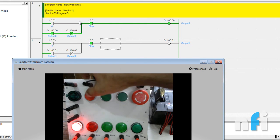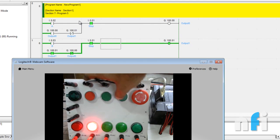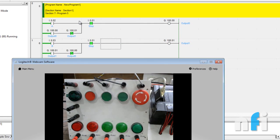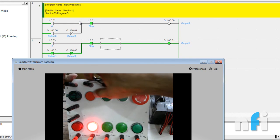This output is latched. To break the latch logic, I press 0.1 which opens the contact and unlatches 100.0. Similarly, if I turn on the other output and press 0.1, it unlatches that one too. These are interlocked, so they work normally between themselves, but if you want to stop the output, just press 0.1. If 0.1 is pressed and held, pressing any input will not turn the output on.